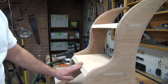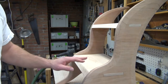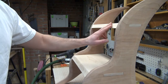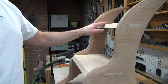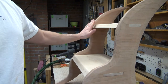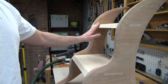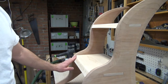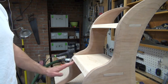I've dry assembled the piece again and I'm really close on the ends of those steps and how they transition into the sides. On the top step, I sanded more heavily in the middle and also on the eased edge on the top and bottom, which gives it a slightly gently curved profile. I didn't do that as much on the bottom step and I really like how that looks because it works well with the curves on the side. So I'm going to shape a little curve into the front of this step — a noticeable but subtle curve to that profile.